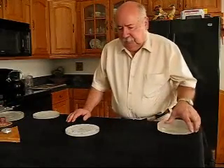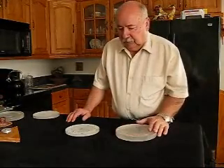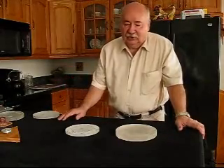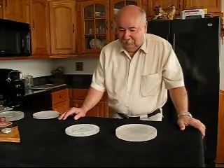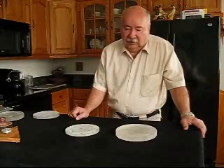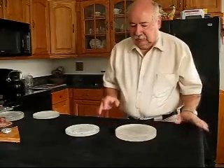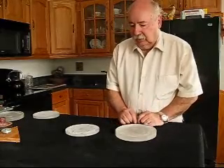At this point I'm going to assume that you've ground the curve into your mirror — or maybe you purchased it, which is actually the best way to do it. I have a machine in the basement so I'll just grind my lens on that. But we'll start from making the penny tool. Once I have the curve, I'll need to make a plaster tool, and then I want to put pennies on that, and we'll start grinding from that.